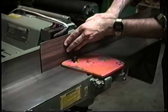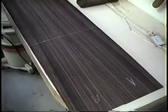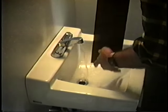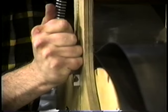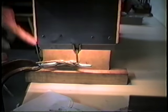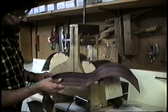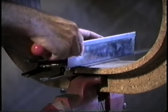First one edge is trued up as a reference for alignment, then the waist position is marked. After the machine warms up for 15 minutes, the side is wetted to create steam which penetrates the wood and accelerates bending. The waist is bent by cranking down on a curved shoe; springs and rollers smooth the upper and lower bouts onto the form, and ends are secured with a line and cleat. The side is left to cool completely, then reheated and cooled again to set the wood — there will be a slight spring back. Once bent, the sides are placed in the female form to further set them and allow trimming to proper dimensions.